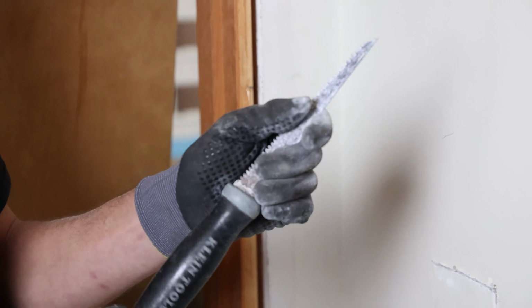All right, broski, more of my right angle drill action across the ceiling here. I'm gonna fish everything down from the top and out the hole here. That is a small target to hit. Going up the wall, way too difficult, so I'm gonna run it this way first. This is a modern 12-2 20 amp wire that's gonna carry me hot from here to the closet lights.